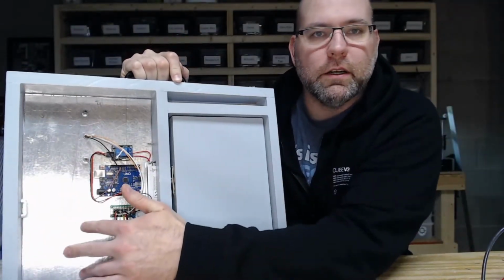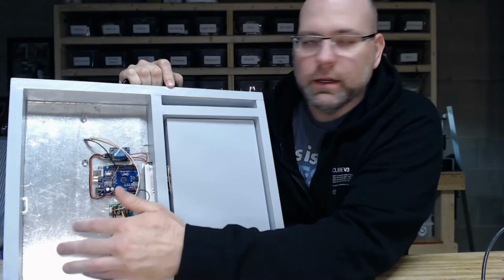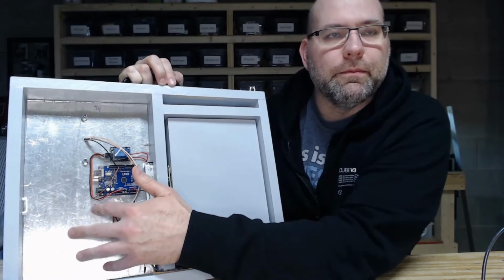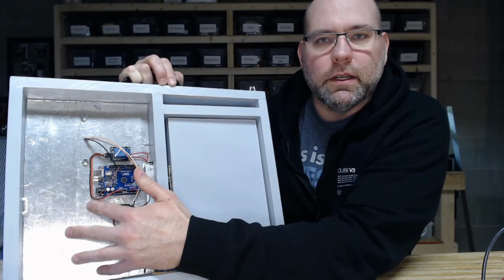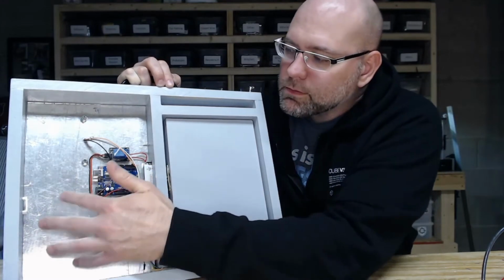What I ended up doing here is I added an aluminum shield, aluminum not being the best material. I think copper or something like that. I know they actually do make special metals as well to reflect these type of signals. Specifically, I'm looking at the 125 kilohertz range, right? So I can block the RFID reader and the noise from the reader.